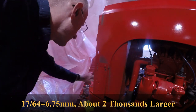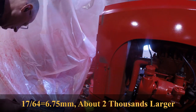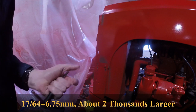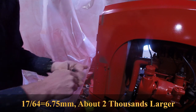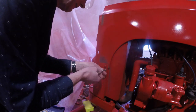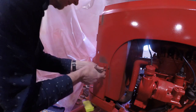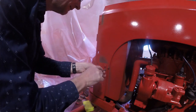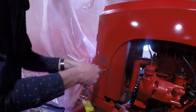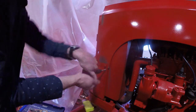And now, let's try. Oh my goodness. My local auto parts NAPA store. Let's try their tap. And that's catching right off the beginning. I already see some chips falling out. And this is exactly what I expected with the OMT kit. A tap that just cuts into mild steel with no drama.